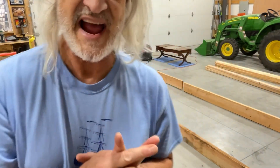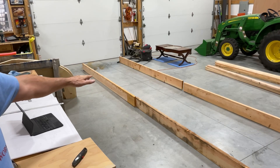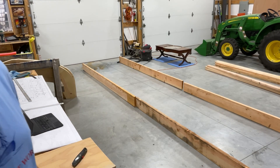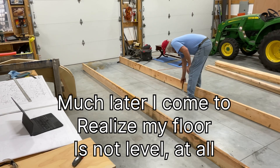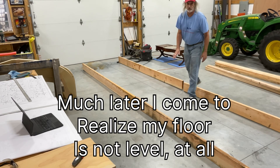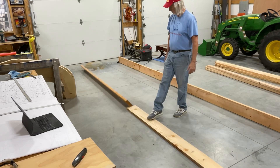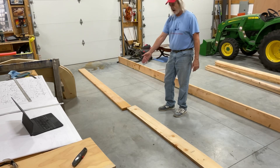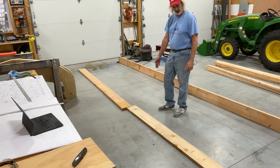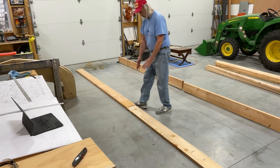I think my floor is pretty flat, but I've got a little bit of rock in a couple of the boards — those two forward ones almost look like a rocking chair. I'm not sure if the edges aren't straight or if the floor isn't straight. So I think what I'm going to do is lay them down, check if they're cut off straight to exactly 90 degrees, and butt them together. That way I should be able to know that at least that part is straight.